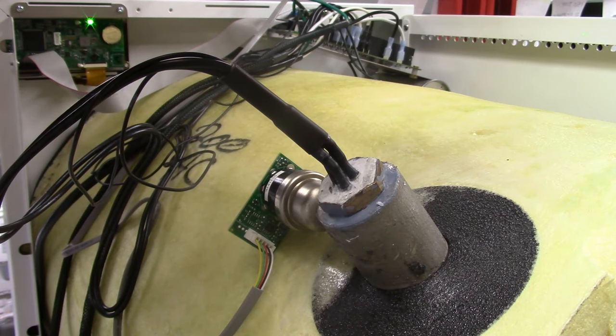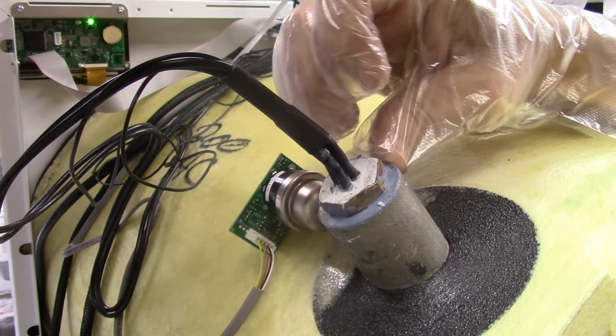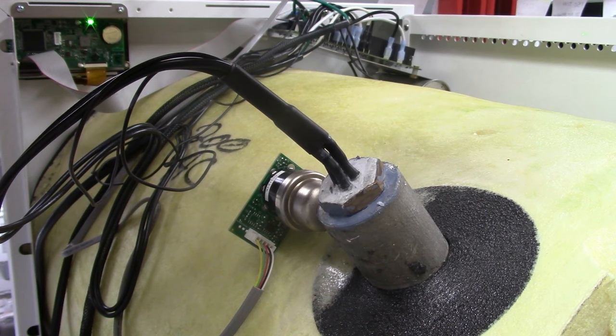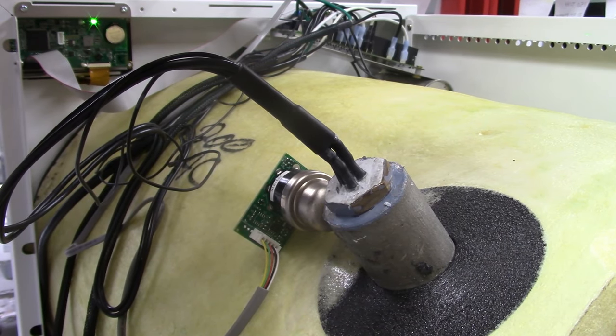I hope you can hear me over the pump. What we did — we went into the test function on the main screen and just put the pump on, nothing else, just the pump itself. That way whenever we apply this liquid tape, it's under vacuum. If there's any little minute micro-gaps or cavities, this liquid tape, being as liquid as it is, will get sucked into that and it will work. It works quite effectively, a whole lot better than RTV. For the die-hard RTV people — it does not work.